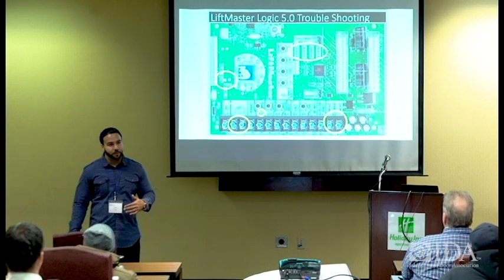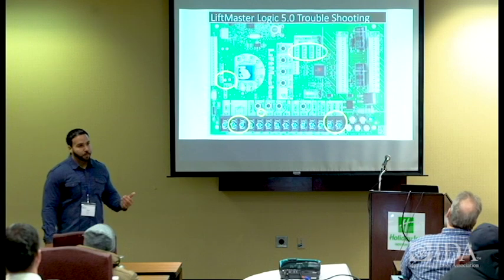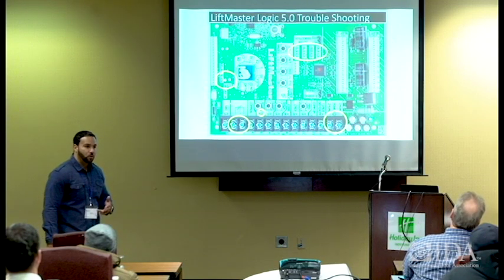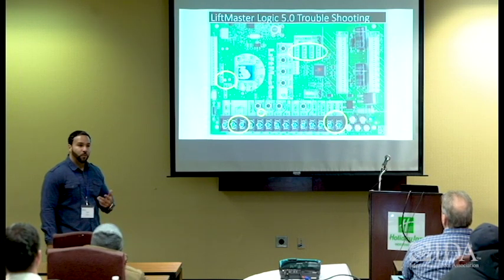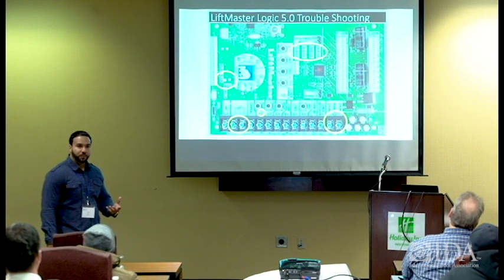If you don't have line voltage there, I recommend you check the overload next. So, backward steps, okay? You can always troubleshoot backwards quicker than you can forward. Backward steps. Now, where's the problem at? Is it with the incoming power? Did the breaker pop? So you gotta look at those things, verify them, make sure that everything is properly aligned, and then get back to the operator.